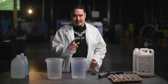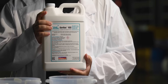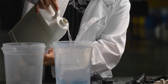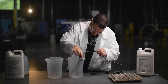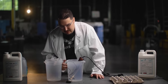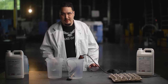And I'm going to show you how easy it is to do. I've got distilled water and our cleaning solution - I'm going to be using ClearClean 4000. I want about three to six parts of the cleaning solution for every 100 parts of water. Now I've got our water heater here, make sure this thing is completely submerged. I'm going to plug in this cheap Amazon heater. I want to get this heated up to about 120 degrees - it'll take about 10 minutes.